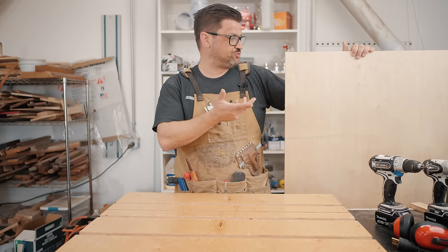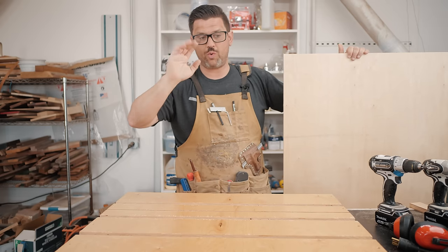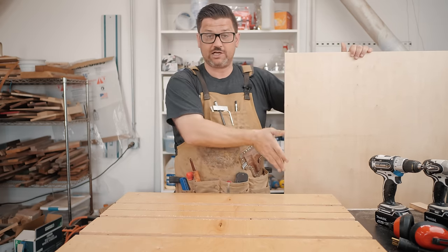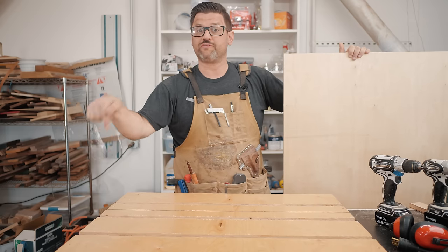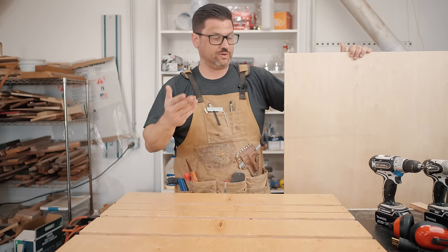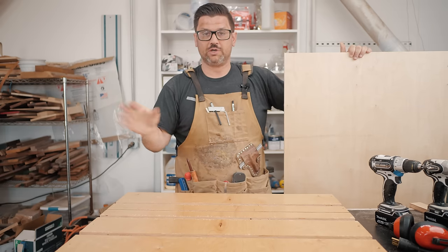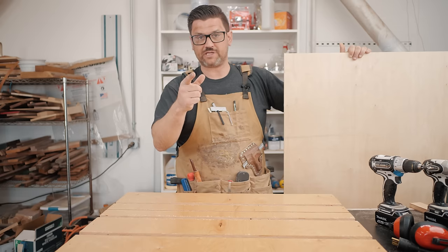So I'm going to rip some half-inch Baltic birch into strips, stack it up, glue it, make sure it's straight and square. We're going to attach one fence, and the other one is going to get holes for the bolts for the T-track. Then we'll put in our white tube, cut our slots in the moving fence so that the white tube isn't going to get in the way, and then we'll wrap this thing up.